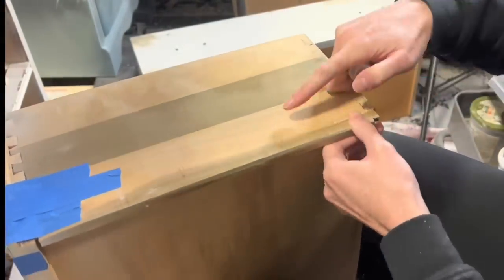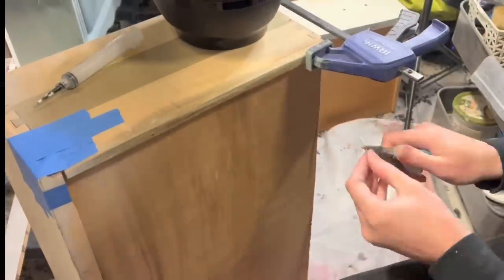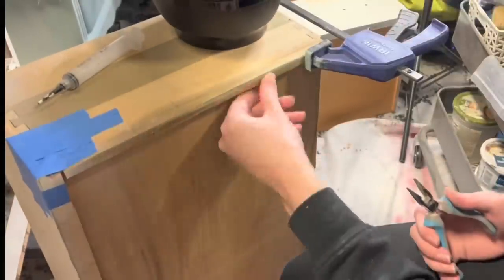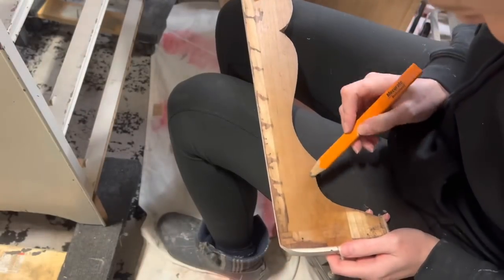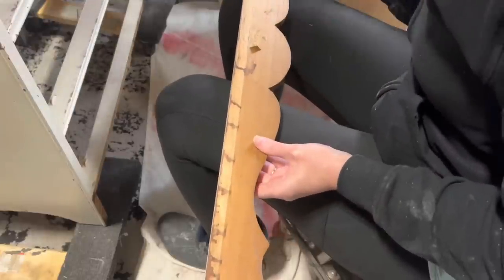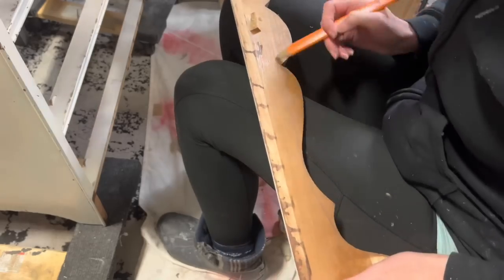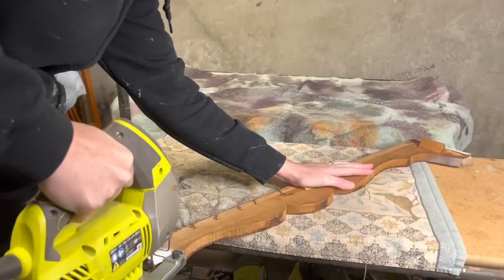Here I just found another repair. You can see they have tiny pin nails in there. I do not ever put pin nails up through the glides — they can tear up the wood underneath. But I will fix that later. Just so you know, it's way better to do a glue-up than it is to put pin nails in.